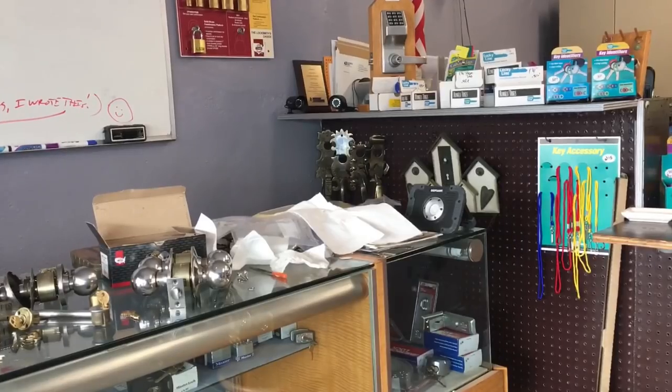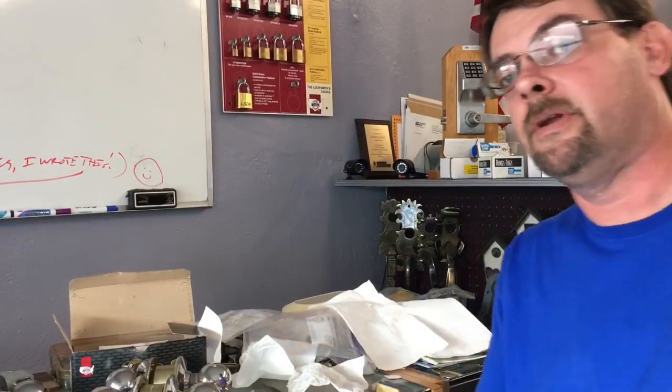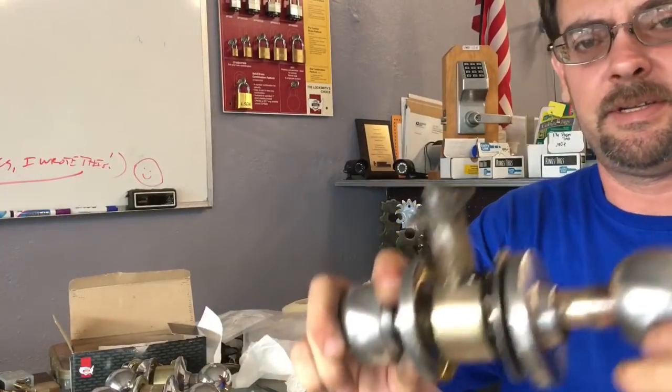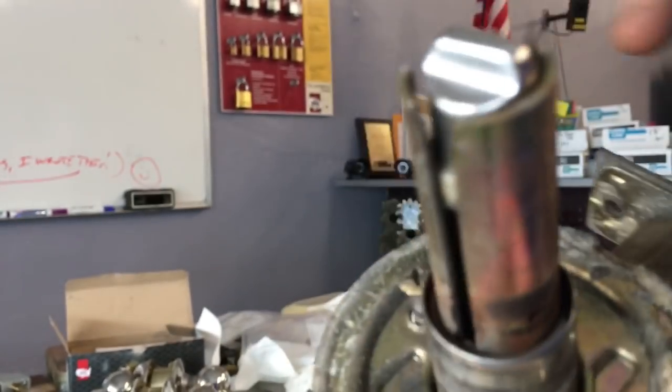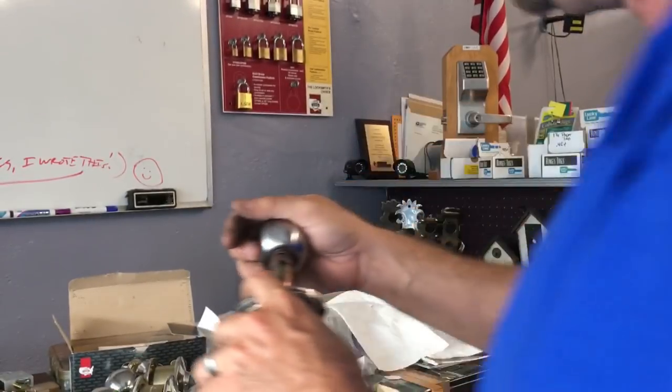This is one of those teaching moments: there's corrosion and there's rust. You really don't have a lot to worry about with rust per se when talking about key cylinders, because brass will corrode but not necessarily rust. Where you start worrying about rust is where you have dissimilar metals. Here is a good case of rust — that is nothing but rust. But if you go down we have both rust and corrosion.